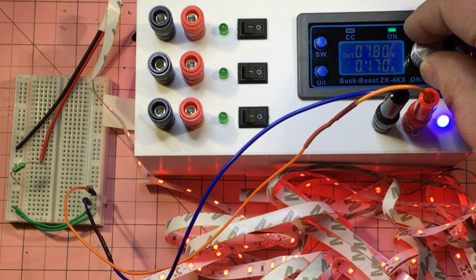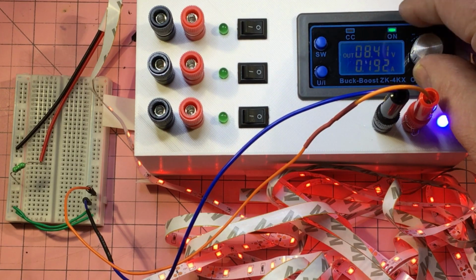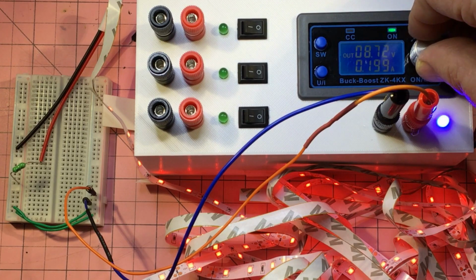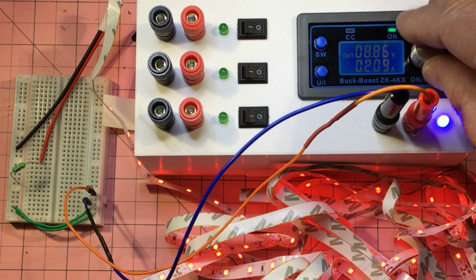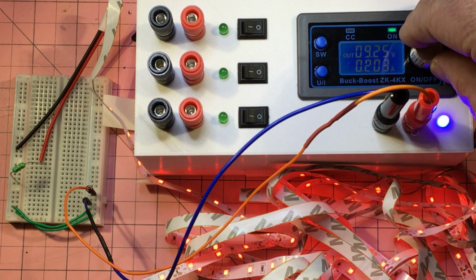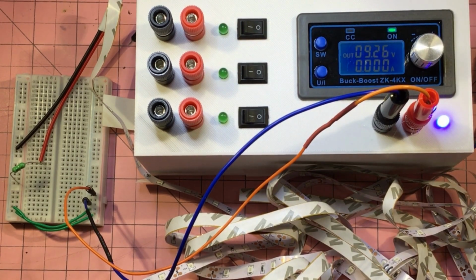It's a bit unexpected. So remember, this fuse is rated 125. Now got 180 going through. This is a bit unexpected. 200. Yes, I guess we'll have to take those ratings with a grain of salt. Remember, I've got it limited at 310, so I don't really squeeze too much more about changing that rating. Oh, and there she goes. Wow, okay. So that fuse did blow at around, I'll have to look at it back on the replay, but I think it was around 210, a little bit higher than the 125.